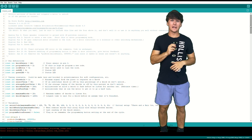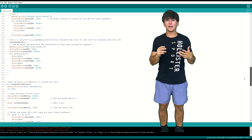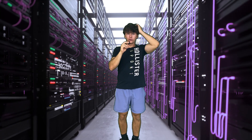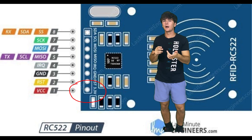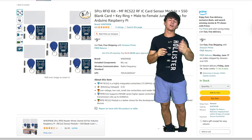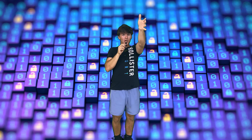That did not happen. The next day I uploaded a different, more complicated code so the key cards could work with different ones I programmed into it. And guess what? The module does not work. I did some research and thought the module uses 3.3 volts and I'd plugged it into the 5 volt — I thought I burned that card. Ten dollars on Amazon, so I ordered a new one. But it turns out that wasn't the issue at all. The issue was I had the reset pin in pin 10 when I programmed it to be in pin 9. So instead of waiting five days for an Amazon package from China, I could have just moved one pin over.